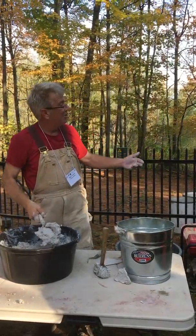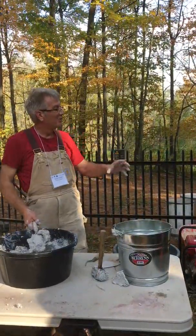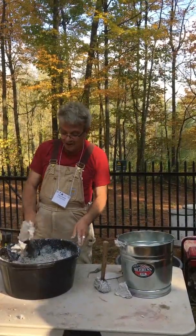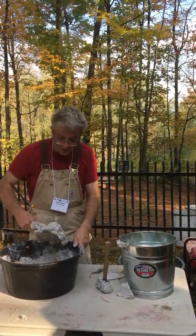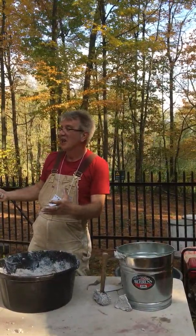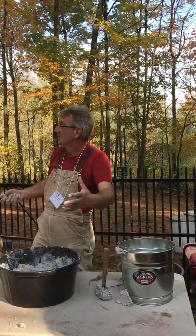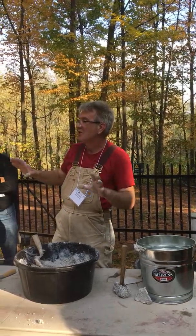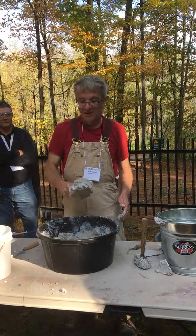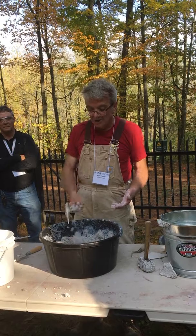I've seen that. I was recently in a church up near Boynton, and it was a cement lime mortar, but it was just full of these bullet holes, so they made the cement lime mortar with quicklime, which was still common in our area. Wherever it was available, they would tend to do it with quicklime, which is another thing I'd like to see tested. I'd like to know what the difference is in the character of the mortar if you use quicklime to make a cement lime mortar or you use hydrate. So there's endless things that we need to test. But at the moment, we just know it works and it's really nice to use. So that's one method.